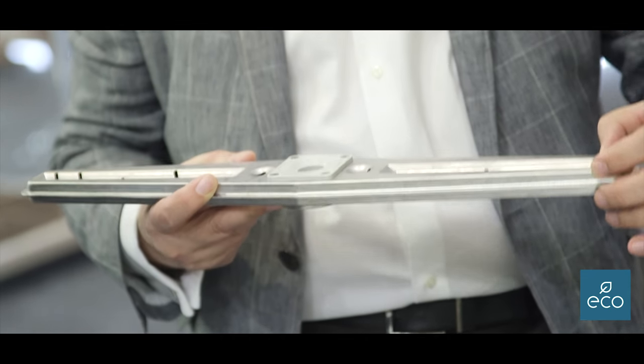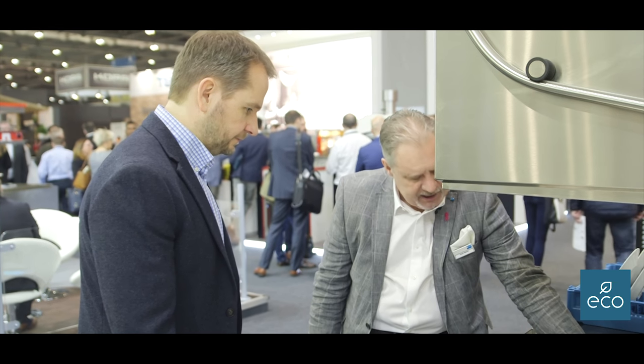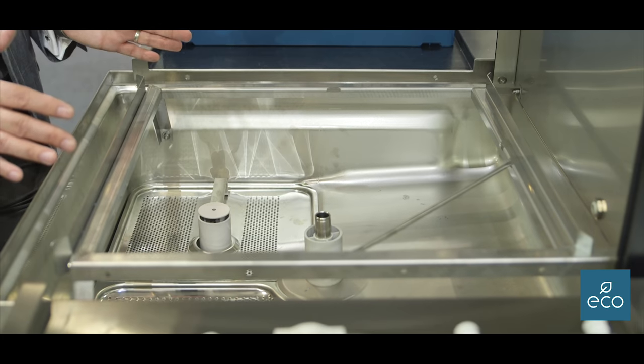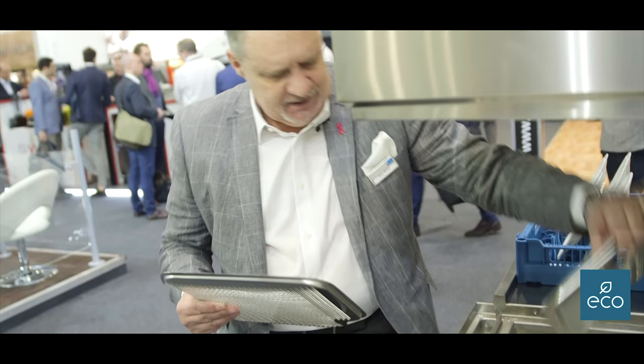There are the indented jets. The tank is pressed in such a way that it slopes towards the front of the machine to the operator. You've got two filter pans which cover the whole wash tank — these lift off so you've got access to your wash tank. This is a deep-drawn tank that only holds 11 litres of fresh water — a small volume — and every time it washes a cycle, it uses 2.7 litres of fresh water.